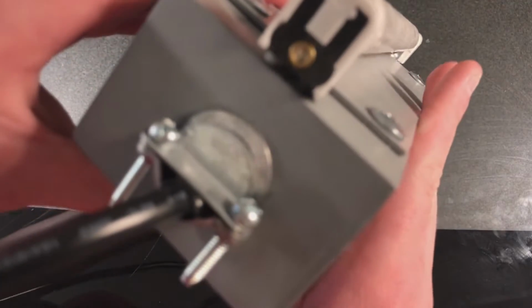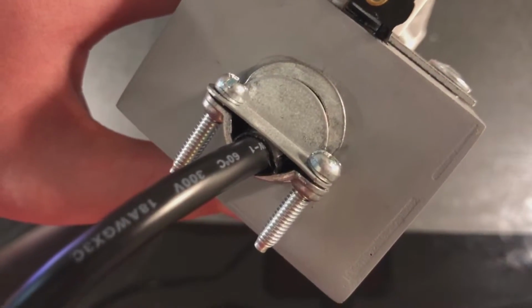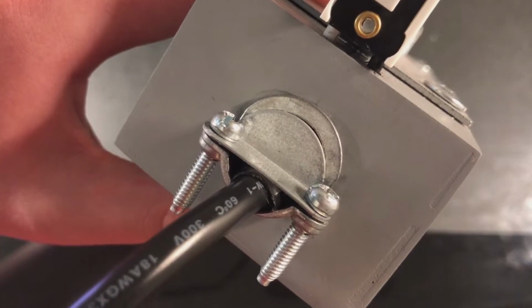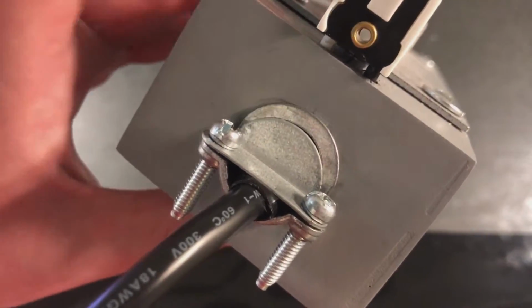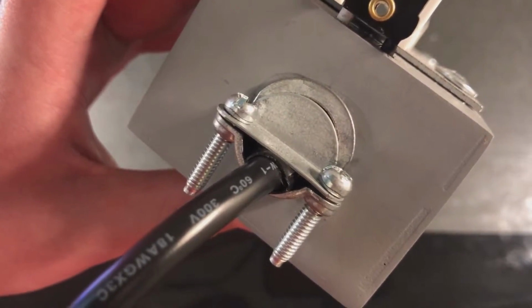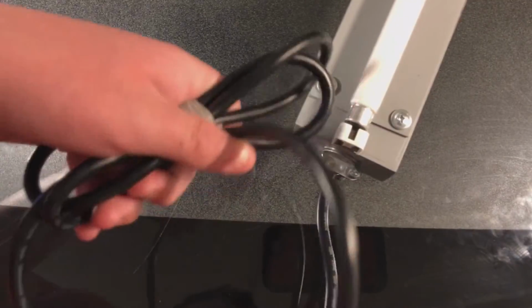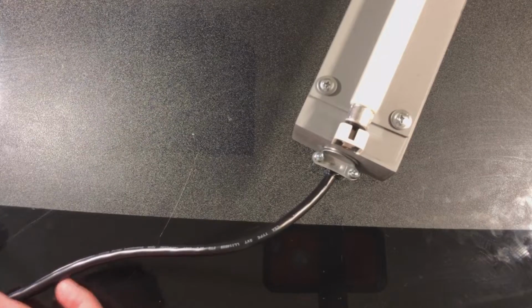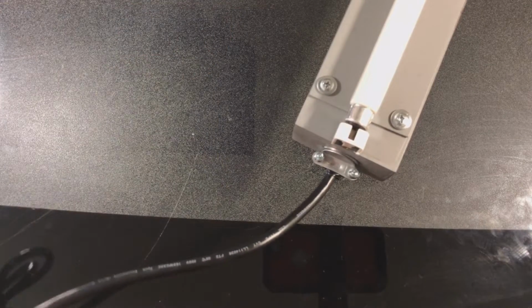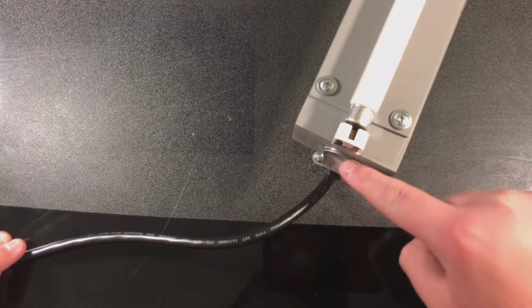And then, on this end of the fixture, we have one of those strain relief things. I think this is meant to go on an electrical box, like in your house, to clamp down on Romex, but they also work pretty good as a strain relief for regular cords as well. So that's good. Whoops. This fixture is very heavy. But anyway, we also have a 5-foot black grounded cord, 18 gauge, on there as well. Of course, it's bundled up here because that is how long I need the cord for my desk here. And that just goes right into the fixture.